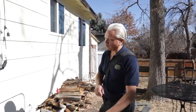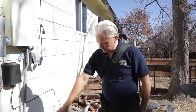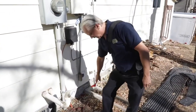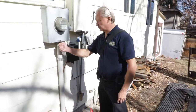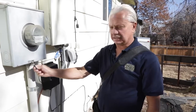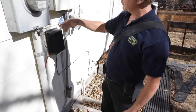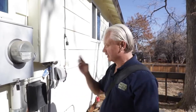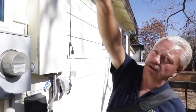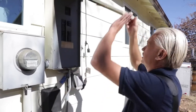Now we're going to look at section 3.7, the electrical system. It starts with your service. On this house we have an underground service — it's actually marked right there because they had somebody mark the yard. First thing we want to do is pull on our meter tag. If it comes apart or if it's cut, we want to write that up as a defect. You can tell somebody painted one and not the other, which makes me think at some point this has been replaced. Looking at the nipple, we have wiring run that looks like it goes over to the garage in conduit. We want to make sure that's always in conduit.